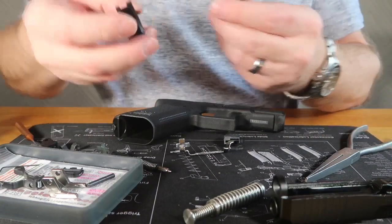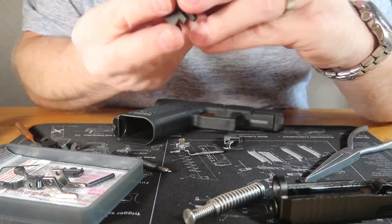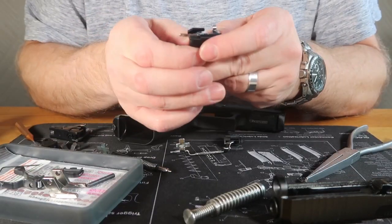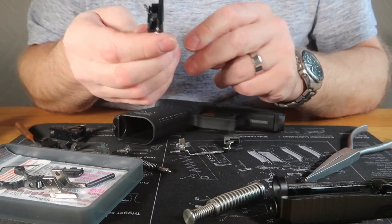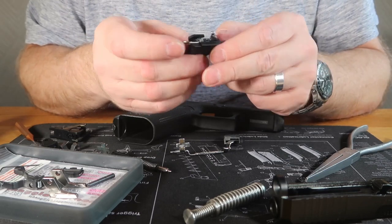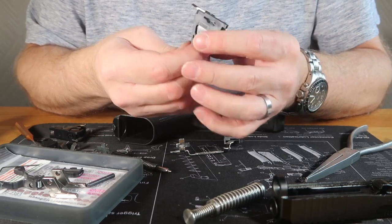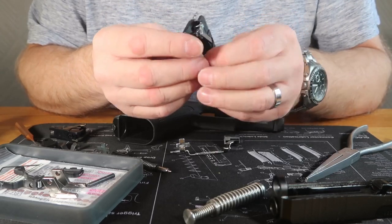Just find the original. Again, if you look at them side by side, that's been completely reprofiled. I'm running the dot connector with this one. Johnny sent it out with the Lone Wolf 3.5 pound connector, which, just the way I've got this one set up, gives the pull quite a spongy feeling, a bit like a water gun. This one just runs perfectly, and I've got the reset and the pre-travel dialed right down, so there's almost no pre-travel and a very, very short reset.